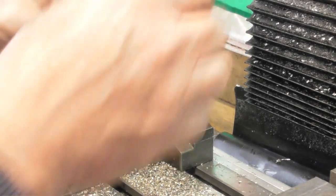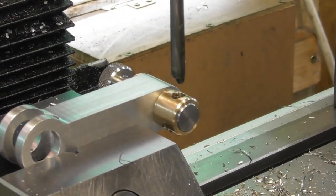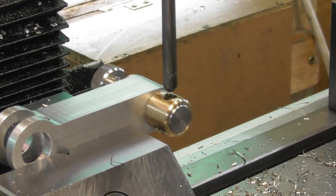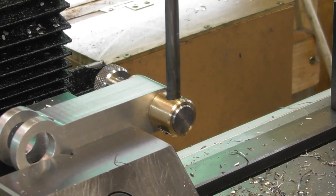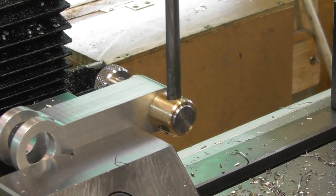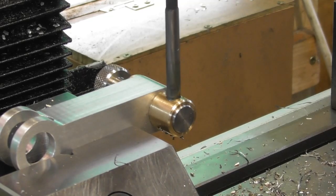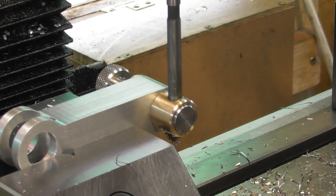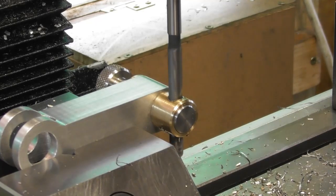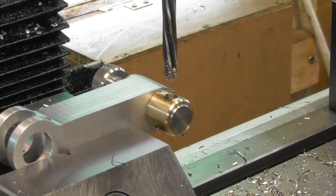So I think I'm going to turn the camera off and find my quarter reamer. So that's the quarter reamer, slowed down, suitable amount of cutting fluid on there. Wouldn't normally use fluid for brass, or cutting compound I should say, but the majority of this hole is steel. Okay, so that's that right through.